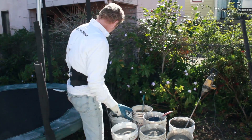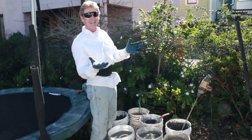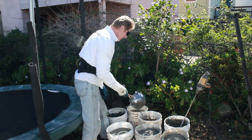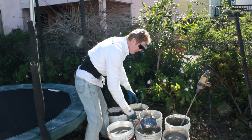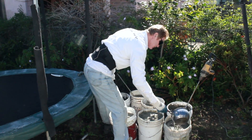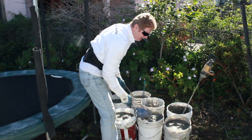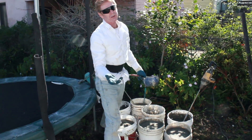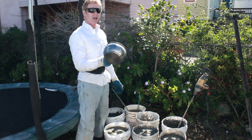As far as how much water to add — get yourself a gallon water bottle, a drinking water bottle, anything, and be consistent. In these buckets I've got three-quarters sand and one-quarter cement plaster. About this much on down is sand, about this much is plaster — so three to one. Usually three parts sand, one part plaster. I think this is roughly three-quarters of a gallon.